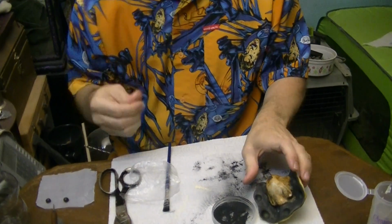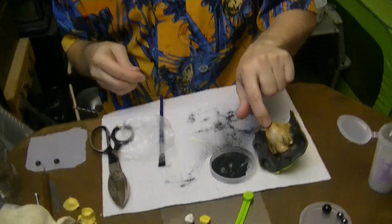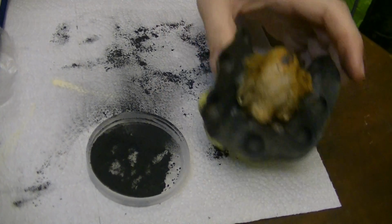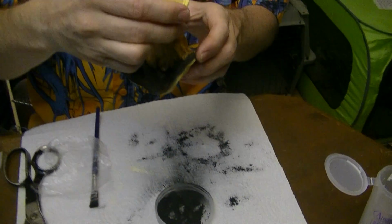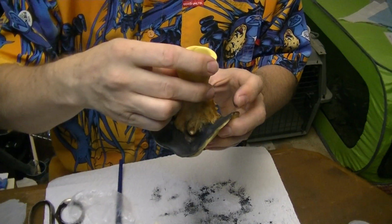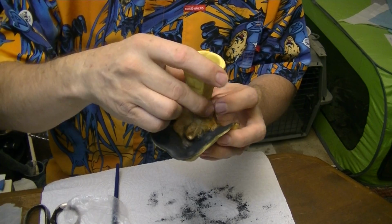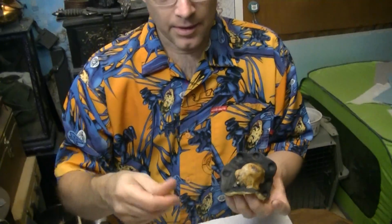So this spot on the top is where we're going to connect the sprue. The sprue is going to be this thing, which is basically a funnel built into the mold to pour the casting material into. This mold is being designed as a mold to pour liquid material into. Examples of that would be things like plaster or resin. Those are very common ways to go.